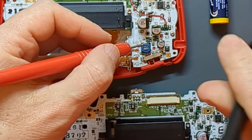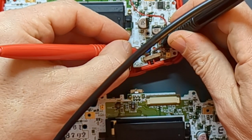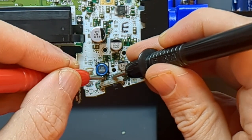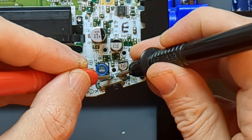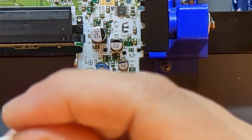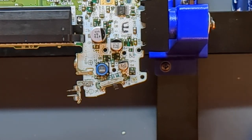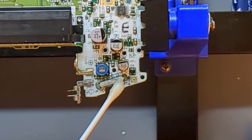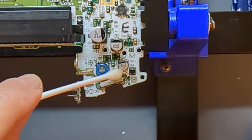When we get it to the switched on position, the central two have continuity with the on position. But looking at the corroded connectors and trying to touch any of those, I'm not getting anything at all. Switched off, I should be able to get a beep from all of those, but because of the corrosion we've got a bit of an issue. So I'm going to take some cotton buds, dip them in the vinegar and try to clean up these points - the acid will react with the corrosion and hopefully get rid of it. I'll slosh a load on the affected areas, move the switch to both positions and just give it time.